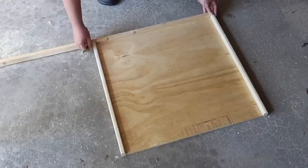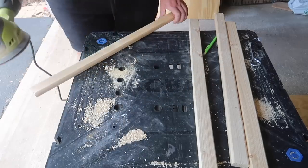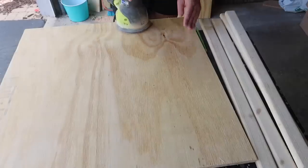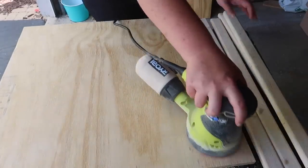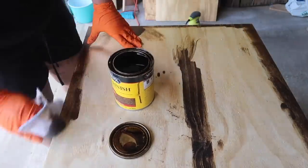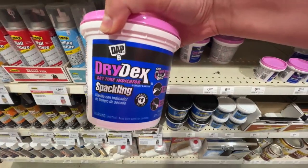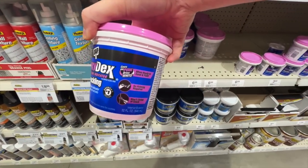I'm going to cut two pieces to either side — about 24 inches — and then two pieces to overlap each edge. We're going to sand all of the framing lumber as well as the back of the sign, and we're also going to stain those as well as the back of the sign in the color Provincial.